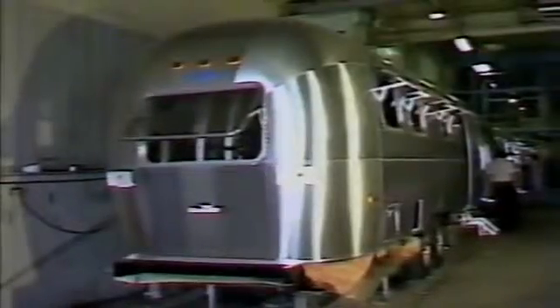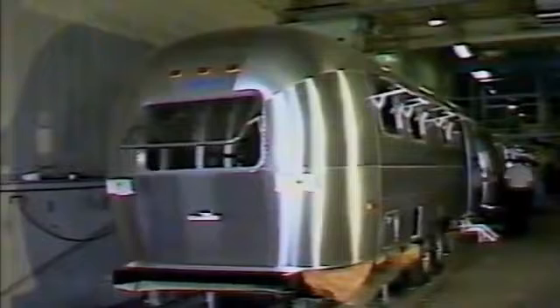This skilled craftsman just finished building this quality curved Airstream door, complete with a keyed security deadbolt available on some models. Now the entire door unit is carefully installed in the sleek aerodynamic fuselage. With the windows and door installed, the entire fuselage is picked up and swung away from the assembly area to be lowered onto the chassis, where the fuselage and floor will be bolted securely to the chassis frame. Then every unit is subjected to a 20-minute high-pressure water test and a rigorous inspection.